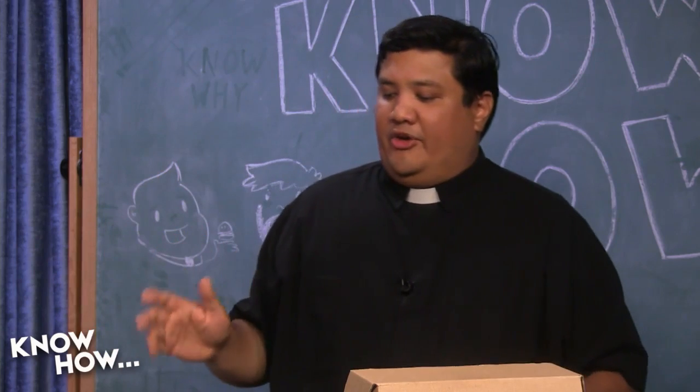The issue with doing that, though, is every time you unwind that filament, you're kind of stressing it a little bit. And if you stress it, there's a possibility it will snap. Yeah. And then you come back and the print has just been going. It's got no filament in it. That's no bueno. The other issue is doing it that way opens it up to contamination. The worst thing that you can get on filament is like the grease from your hands.